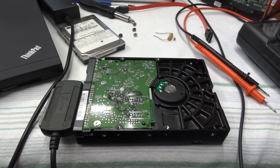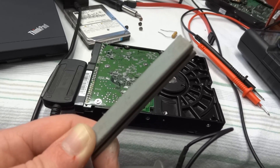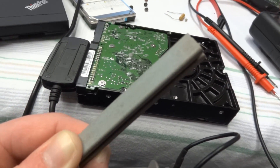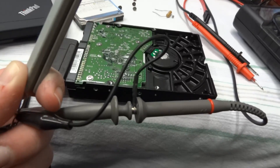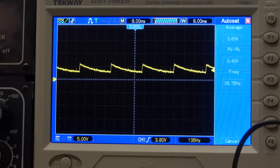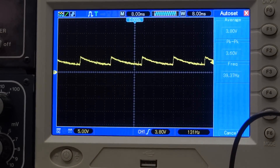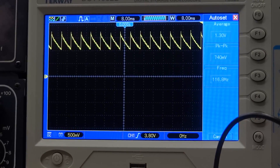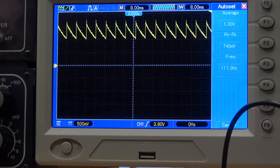I am getting 12 volts and 5 volts out of there when I measure it. However, it's still not able to spin up any hard drives — I tried a bunch of them and it just doesn't work. So I put a 33-ohm resistor in there to cause a significant current flow, simulating what the drives would draw when spinning up. With the scope hooked up, we're getting a pretty significant amount of ripple and our average voltage is down to 3.8 volts on the 5-volt rail — that's not going to be enough to run anything. And on the 12-volt rail there is a huge amount of ripple; instead of 12 volts we're getting 1.3 volts. Something's got to be wrong.